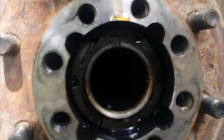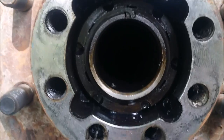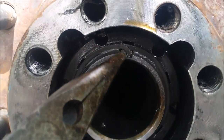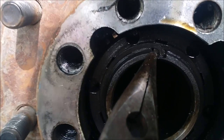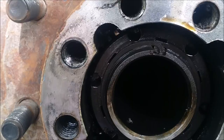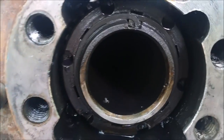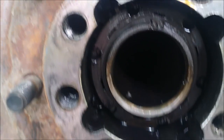This is the part I always forget: if you look up inside here, there's some things you've got to take out. Right there is the end of a spring clamp that goes all the way around - you've got to pull that spring off. Right behind that is a little metal square - that's the key in this keyway. Pull that out, it's super easy with a magnet. Then this ring back here will unscrew and unthread, and then this will just slide right off.